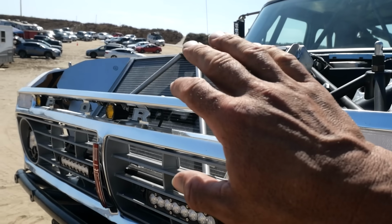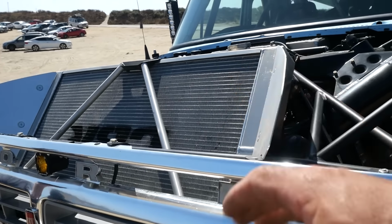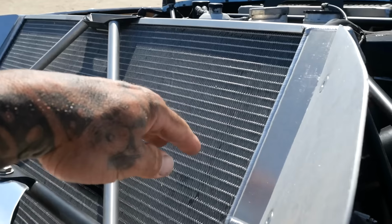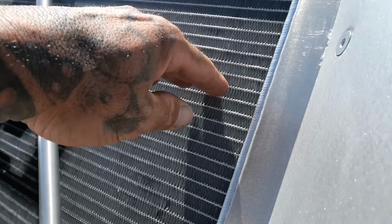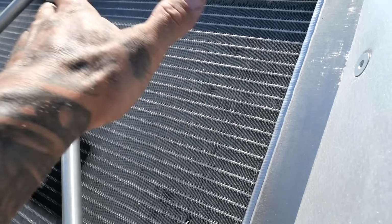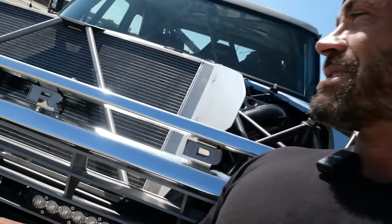I think the only thing you have to think about when you're putting a big radiator up front is if you're leaning it back more, the air wants to go parallel into the fins. So if these fins are vertical here, then they want parallel or perpendicular air, whatever. You get what I'm saying? So if you're doing that, I think the thing we missed, because it was running hot still, and Clint at CBR said, just direct the air. Make it where it doesn't have anywhere else to go, and it is directed in. Yeah, force-feed it in there.